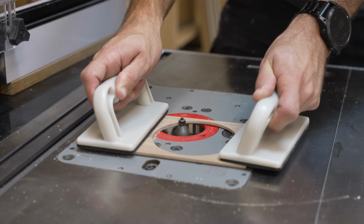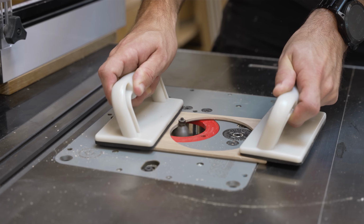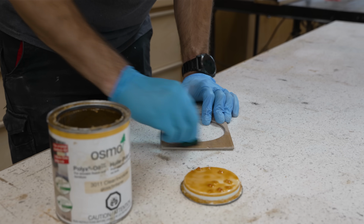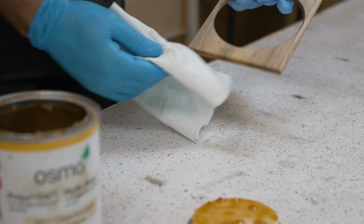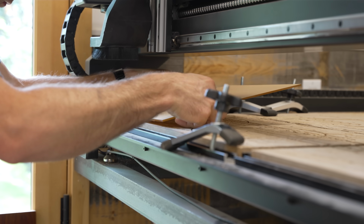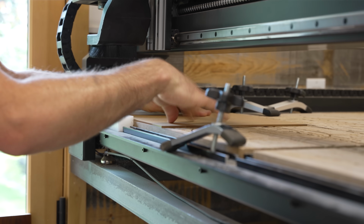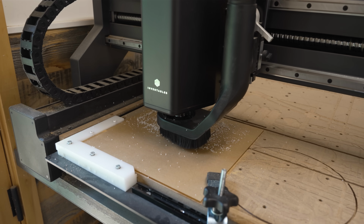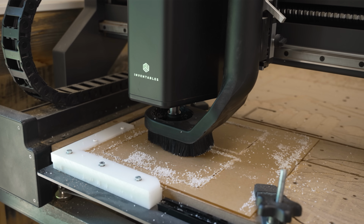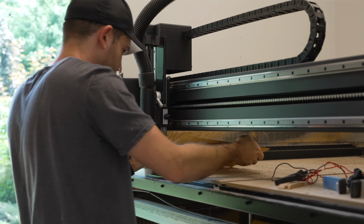In theory, this might also make the fan a little quieter too, but I've got something much better planned for that later. A quick oil rub finish sealed the wood, and to my eyes anyways, gave it a much nicer finish as well. And while the CNC was still warmed up, I also cut the two acrylic side windows that I mentioned earlier. As always, make sure that you get cast acrylic instead of extruded acrylic for use on the CNC. It cuts so much nicer and won't crack or chip on you.